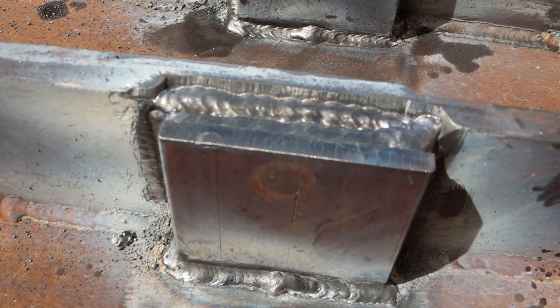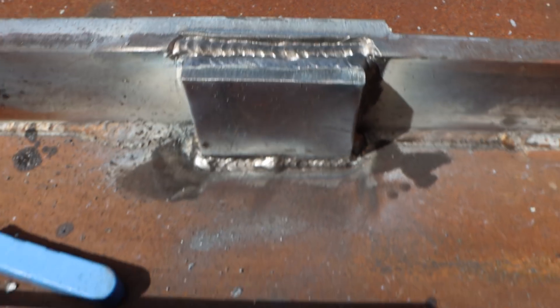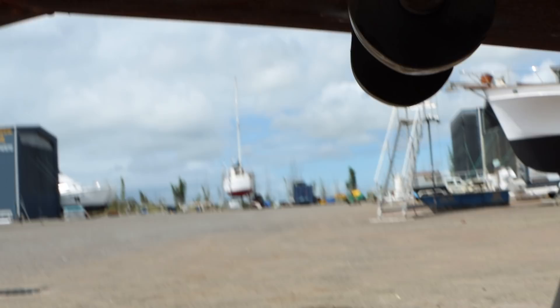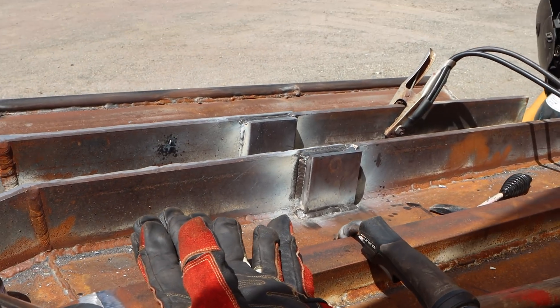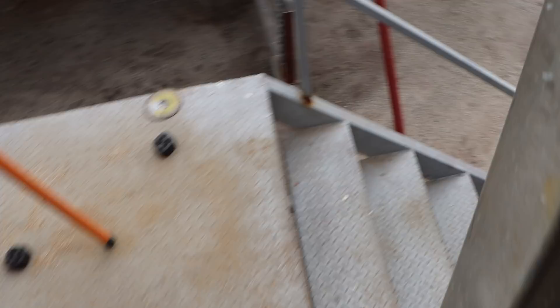You can see they're coming along quite nicely. Got a couple of runs down the middle — one root run and then two capping runs. I'll probably put another three on each of those, and we've got one down either side that I'll beef up with about three more on each as well. Underneath, the thing I was most wanting to make sure happened — lovely free pin. That's really critical that the pin stays free, and I think it's worked out all right with the welding; nothing's warped too much so far. That old regulator seems to be working out sweet — I just assumed the new one would be better, but the old one's awesome compared to the new one. We've got a bit of rain coming in, so let's see if we can get this welding done before that delays our work.